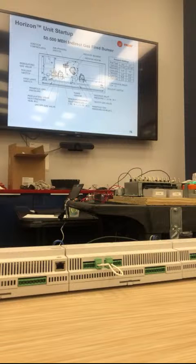And included in that, if you look at it over time, basically as your temperature starts to go, when you turn that burner on and it starts to go along this line, that's a 10 degree rise. Your delta starts to go down over time because the heat exchangers have to cool off as it ramps down. So if you're staging on that second stage of gas heat and the first one goes to minimum, there's a period where it's cooling off. But at that point, it's already overshot the discharge, and within a couple of minutes, it stages that second heat off.